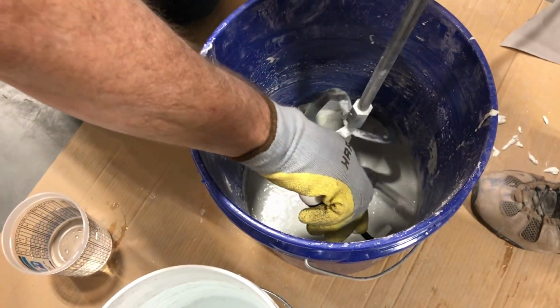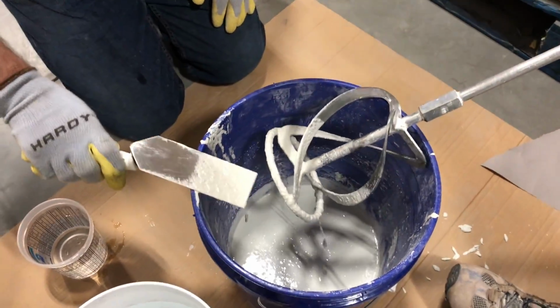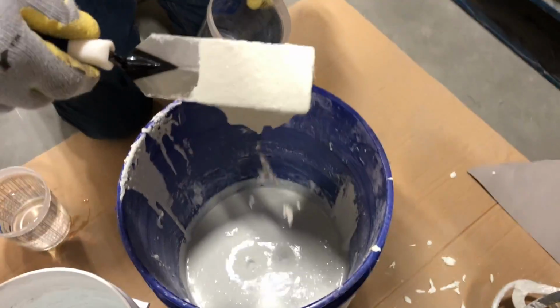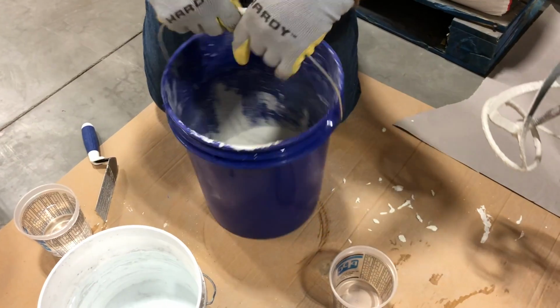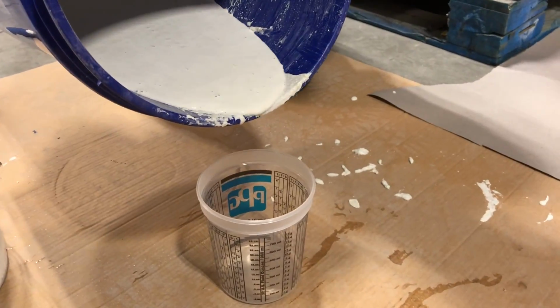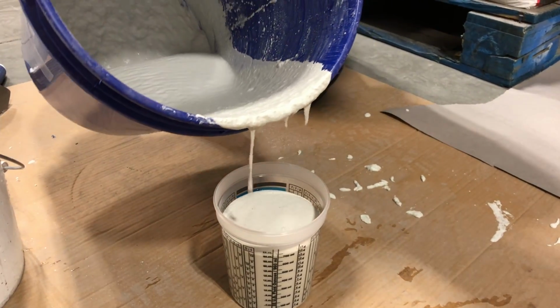This looks about right. The consistency you opt for can vary depending on your preference. We find the more flowable mix is slightly easier to control and will level off better. You want to avoid overwatering, which could lead to a separation and a weaker final product. As a rule of thumb, do not make your mix any wetter than what you see here, and you will be fine.